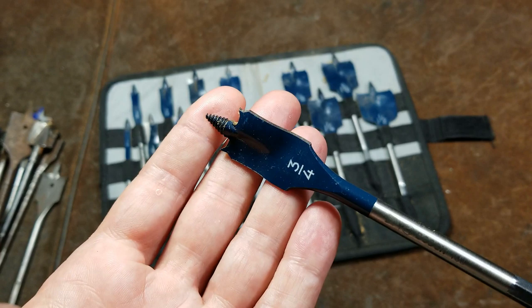I'm not going to use an impact driver here. What I've realized about impacting wood drill bits is you do it when you need to, but all it does is make a whole bunch of noise. When an impact wrench is operating, your effective RPM is very low — a few hundred under good situations. For driving spade bits, I prefer a drill because it's a fixed connection running at a specific RPM, giving you a much faster drilling operation. The holes also tend to be better because it's one continuous smooth cut instead of a series of little intermittent cuts.